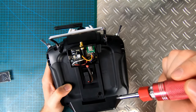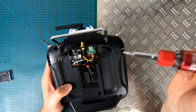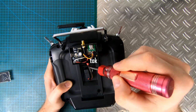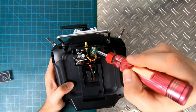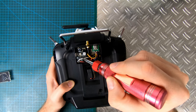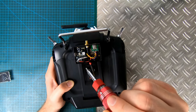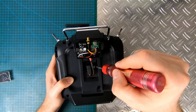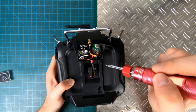It's a lot of cables because of this connector. If you use the big Crossfire module, you don't actually need to do this — you can route the cables directly into your big Crossfire module. You have four cables coming out of the Futaba radio. One is this yellow wire which goes directly to the USB-C — that is the trainer connection. The white cable is connected to the data pin of the Crossfire. The black is your ground and the red is your power.